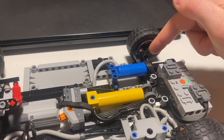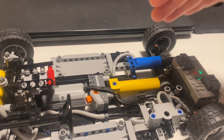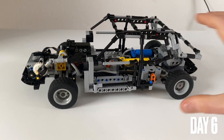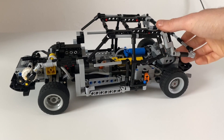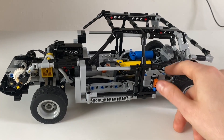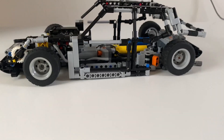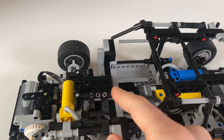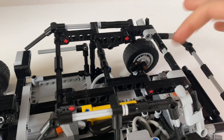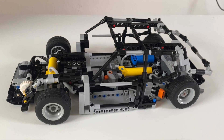The final thing I worked on was the rear suspension — specifically the length of the arms, which affects both the range of motion and the stiffness relative to the lever attached to the pneumatic actuator. I've now started creating a general framework for the bodywork, including opening doors and an opening rear hatch. The overall shape is decent — you can really see the SM shape coming through. If I drop the suspension and look at it from a low angle, that profile is actually looking decent. I've also been covering up the engine with details so it now looks quite sleek, and I've added suggestions of brake discs at the rear — not the front, since the SM had inboard brakes there.